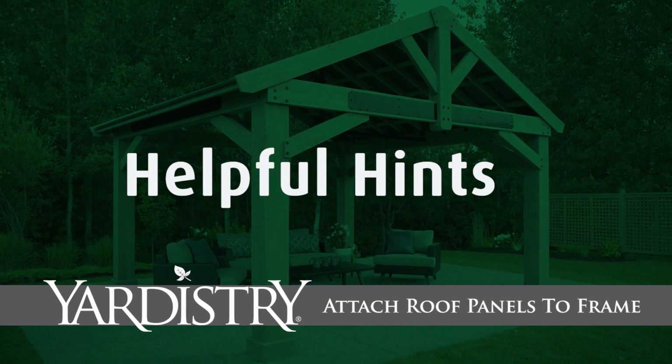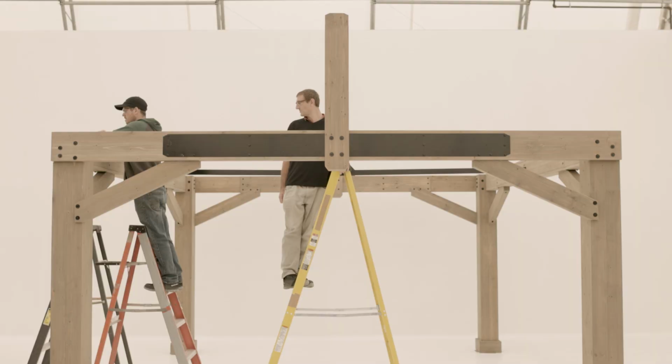Attach roof panels to frame. Do not attempt this part of the assembly in windy conditions. You'll need 4 people and 3 ladders for this part of the assembly. Assign 1 person to remain in the middle throughout the roof assembly to support the roof panels. Ladder placement is important for this step.